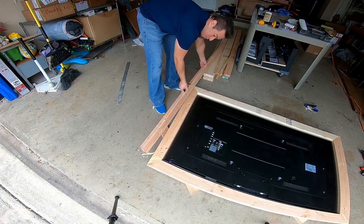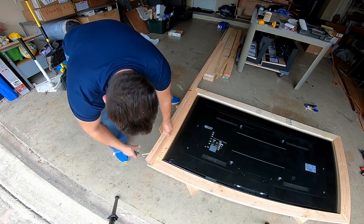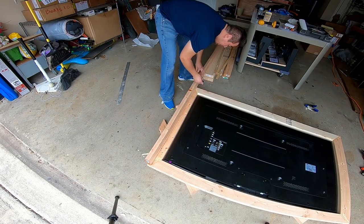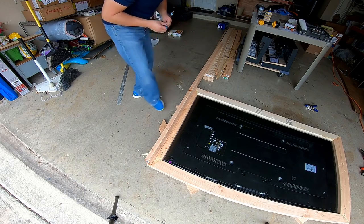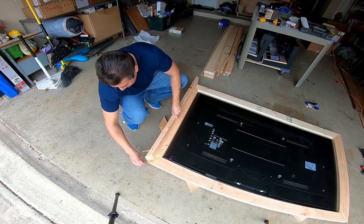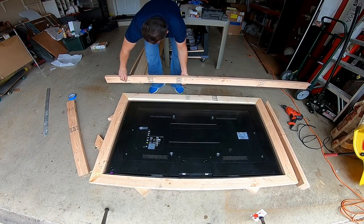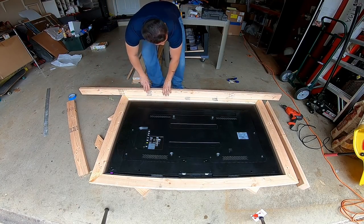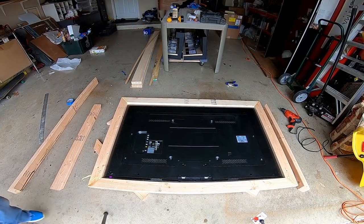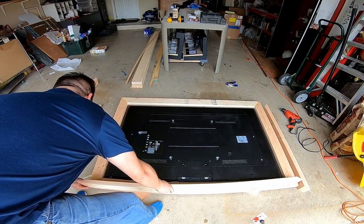Just like I did before, we're going to keep it low tech. I'm just going to take this piece of wood, frame it on the outer edge, match that up, mark our cut, and then use this as a template for the other side. Here's the first cut — it's going to be on the outer edge and match up with the outside border. We're going to repeat on this side too. At this point, all the frame for the bottom of the table is built.